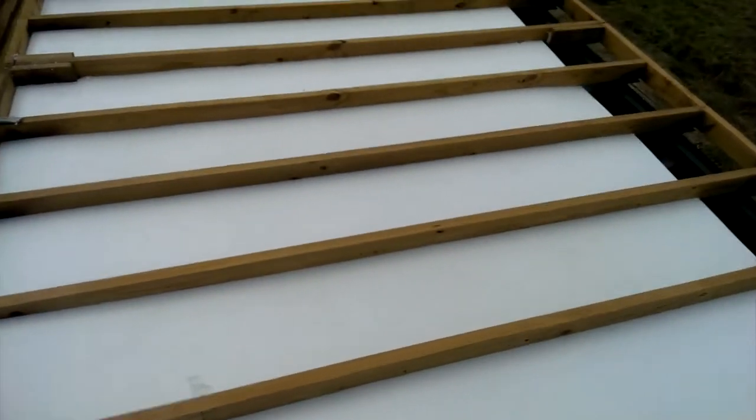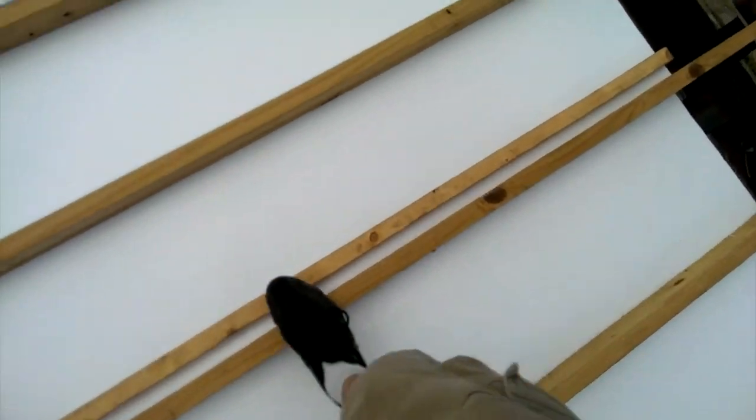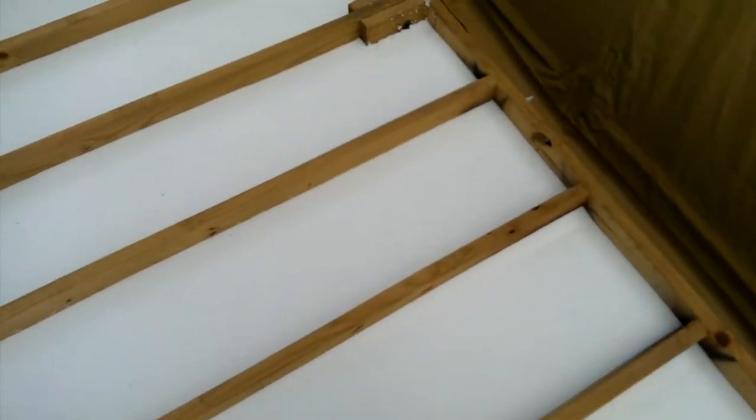On top of the deck, putting down the polystyrene foam. It's pretty easy. All I'm doing to get a nice uniform layer across here — since this is just going on the runners — I'm just using a 2x2 stick; a 2x4 would work as well. I lower one corner in first, then just walk and step down on it, and then it's nice and flat. I cut these a little bit wider than 14-and-a-half inches just so they'd stick a little better and close off the gap — no gap in between, just a little bit more air tightness. Just don't cut it too much wider or else you're not going to be able to fit your panels down in there.